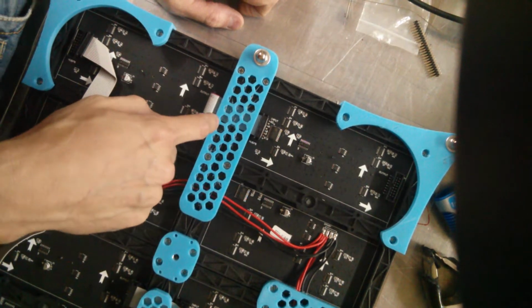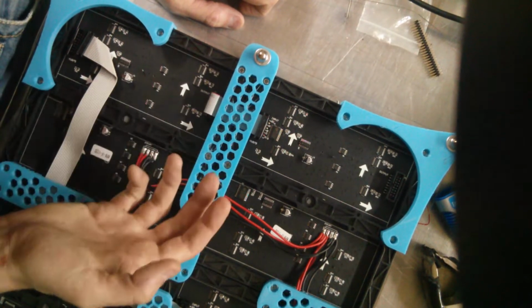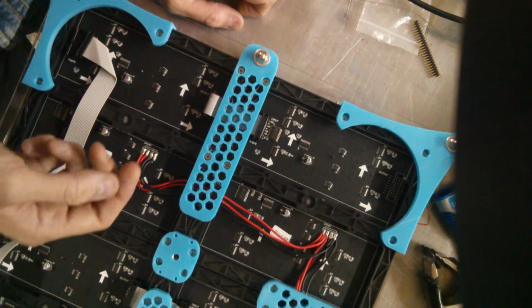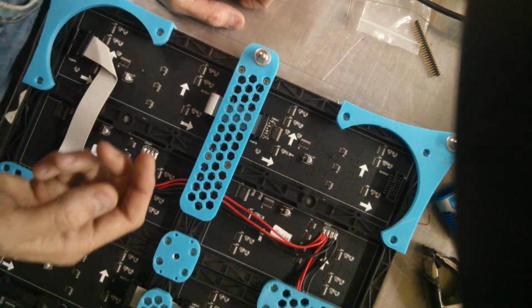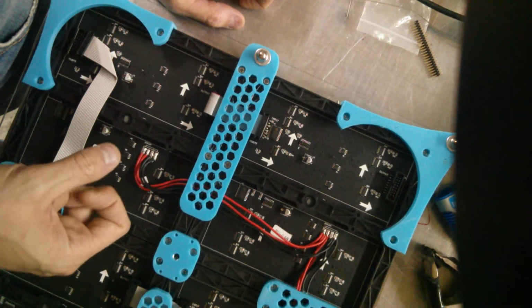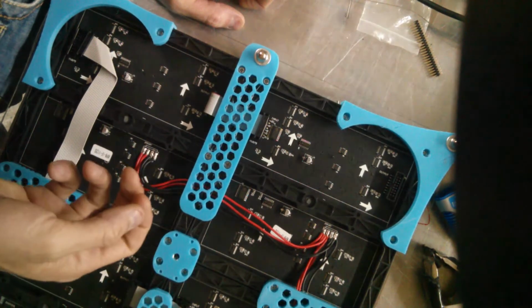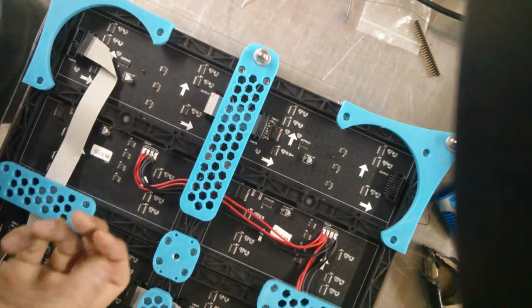But in the modifiers pane in object mode, you can add a modifier called array, and you take that one cylinder and add the array modifier to it, and you can build these arrays without having to replicate your geometry everywhere. That's really useful if you decide you want to resize that one piece and have all of the others resize and scale to fit appropriately. And it's just done automatically because it's generated.